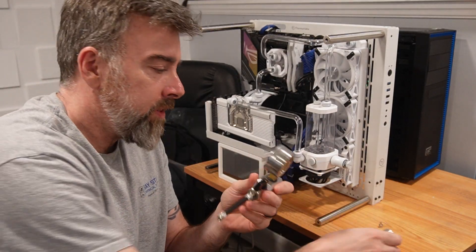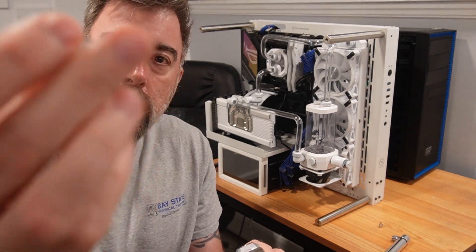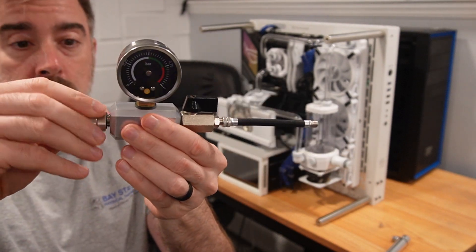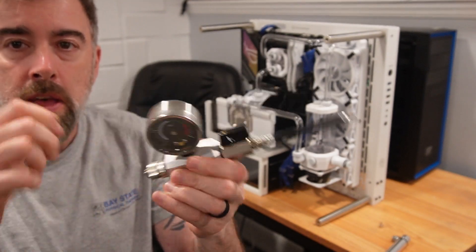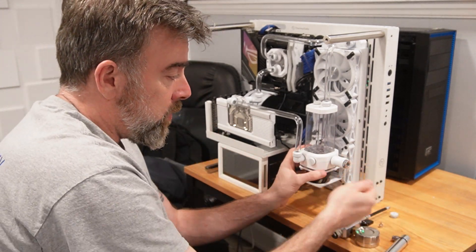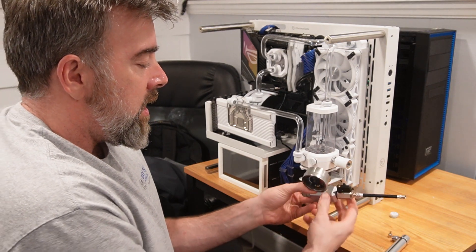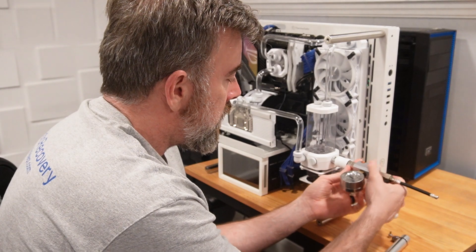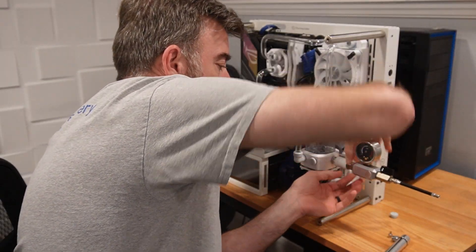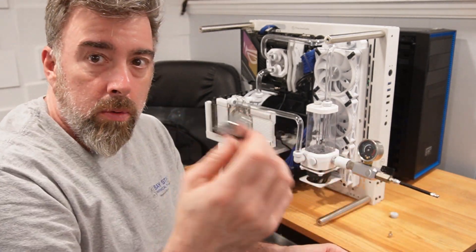We're going to take our connector. Now, there are actually two different size threads — make sure you put the right size thread into the pressure gauge, just make sure it's got a good seal. From there we're going to plug it in. Unscrew the cap off the end. This is a pull valve, so we're going to pull it open so the valve's completely open, so we can actually put it in there. Then we're going to screw the pressure gauge into it. Make sure it's not too tight — we don't want it leaking. And then this moves back and forth. Now that that's on, we're going to put the pump on the end.